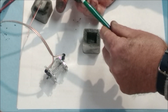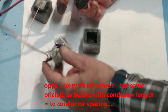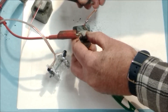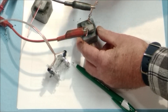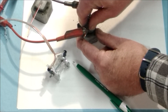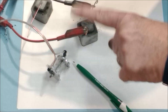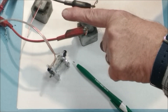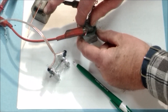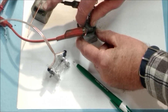By definition, just like the last probe, we have two conductors where the length of the conductors equals the spacing between them. When we put bulk material inside the cube and compress it, the only contacts made to the material are the two parallel copper bars. We can compress it — obviously not as thin as an ink — but we're measuring resistance across the surface from one bar to the other, not through the bulk. This gives a number more representative of what is possible with a conductive ink.